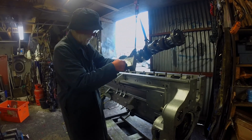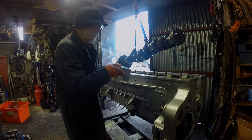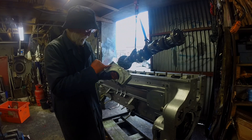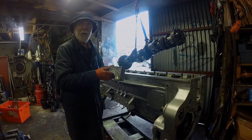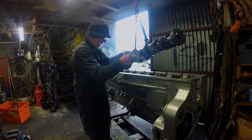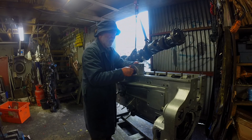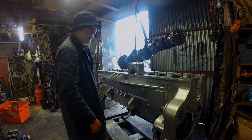They are, again, typical of Gardner. They are numbered here so that unless you're being particularly careless, you can't put them on wrong and you can't put them on the wrong way around. The numbers match up with numbers on the crankcase, so it's not possible to do it wrong.